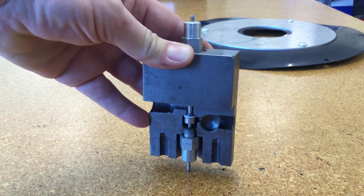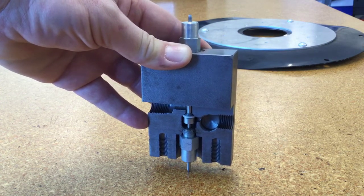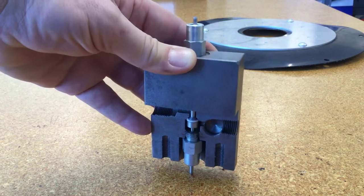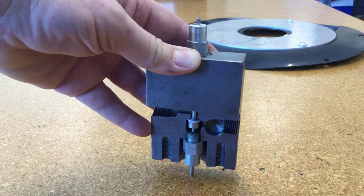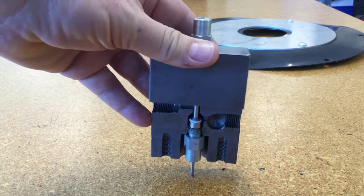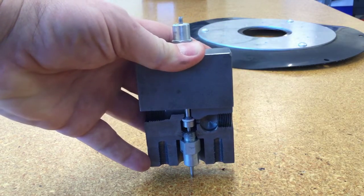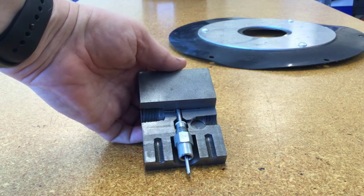If any of you recognizes the spud that we used here, it's the same one we use on the MSP valves. So you could take either a 563-272 or 563-273 switch, which are typically used to count cycles on a divider valve, and you could mount that to the top of this so that you could see when that pin sticks up and get an electronic signal. And that's all there is to it.